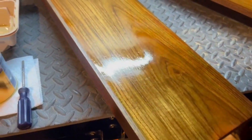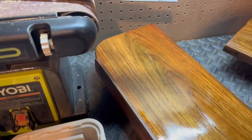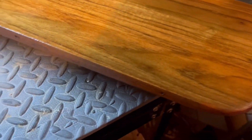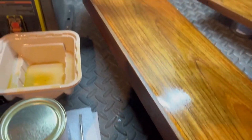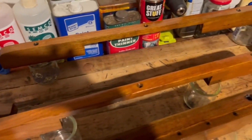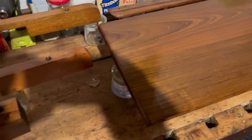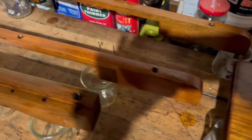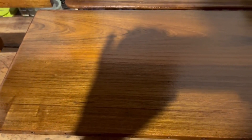Back in the saddle — my first varnish coat is about 50% Interlux 333 brushing liquid and 50% Interlux Schooner varnish, making it a very light coat. The boards are still wet right now but they look pretty good. I have other pieces also getting this first coat with the 50/50 thinning ratio. I'll let one side dry for a day, then do the other sides.